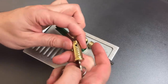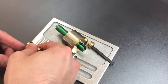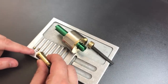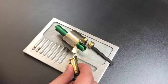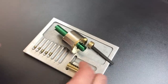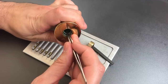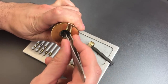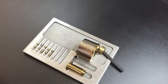The first thing I see is the fact that this is a six-pin core but it only has five pins keyed up — that's always a disappointment. Key pin number one is a double-sided key pin, much like you would see in a Kwikset. Key pin number two is a very deep spool; I've actually seen in Masterlock literature that these were being included in the pinning kits now, though I've not seen one before. That's probably going to make this a lot more rake resistant than most other locks. I didn't feel anything special with the exception of that anti-bump pin in slot two — and yes, that's definitely a bump stop pin. Everything else looks standard, as it felt like when we were picking it.